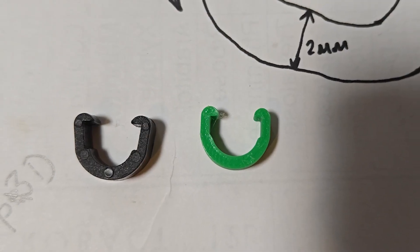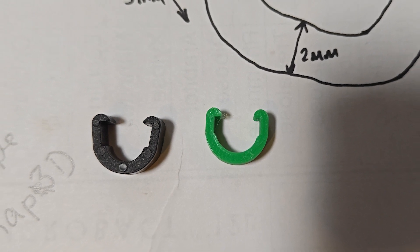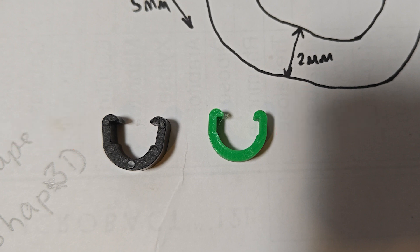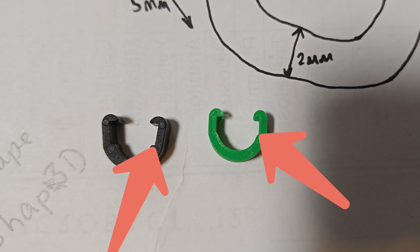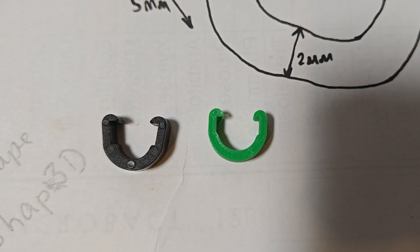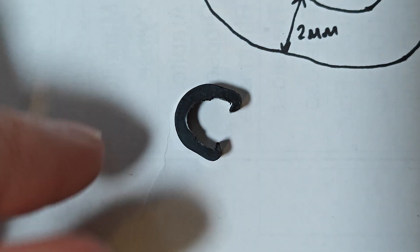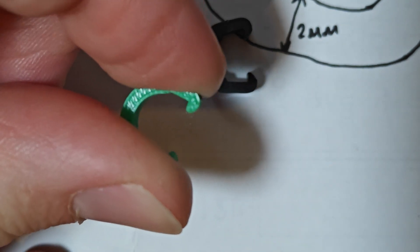So this is a side-by-side comparison between the 3D printed one and the original, and there are kind of three differences. One is the vertical outside lines of the 3D printed one — not quite the same as the original. Second is the sharpness of the corners, and that might be because the original one's been worn in, or because of the way the 3D printer works with the round nozzle. The third difference is the top overhang isn't quite as long on the 3D printed one. But it's a pretty good first try, so I think we'll have a go and see if it fits. Little flex test — the original one, not so much for this, so this might need to be printed in something other than PLA.